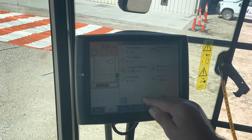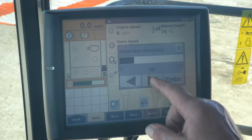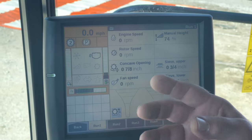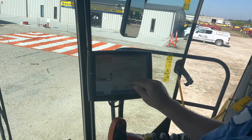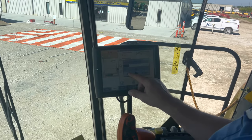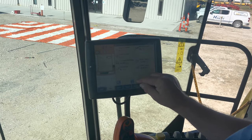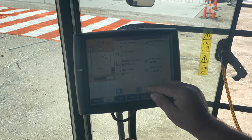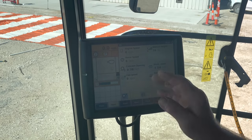On your sieve loss, they normally come out at 25 from the factory - that's a pretty good setting. But in greener beans, you get green hulls going off the back of your sieves and it'll run that real high in these funnels. So I would drop it back to 20 and try to leave it set there, which would keep your sieve loss in a good range. You can also look on your chaff spreader on your rear axle to see if beans are coming off the back.